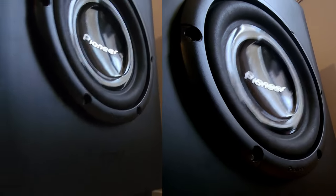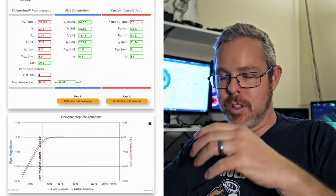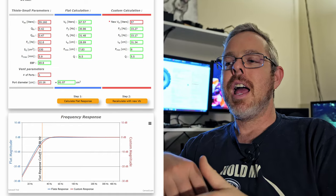You might think that you just take these speakers, throw them in a box, and they work. That's kind of what I did with this, but I did do research. The subwoofer, on the other hand, I did a lot of research, and I have specs for these guys. The TS parameters for this, because this usually goes in a car door, and they don't give you TS parameters. TS parameters is what you could plug into a simulation, and it'll tell you what frequencies it will hit. But like I said, these guys right here didn't really have that, and there's a certain space that they had to fit, which is on this desk right here. You can see it has to go back into this little section underneath this. That was kind of my requirements.